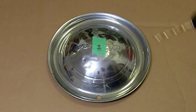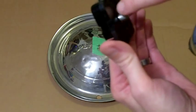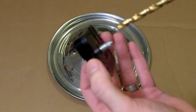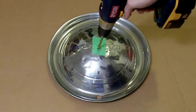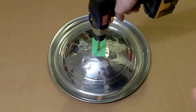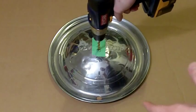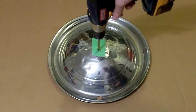Next, find a drill bit whose diameter matches the shaft of the clock mechanism — just barely bigger than that threaded shaft. You don't want it huge and you don't want it too small. Then simply line up on the cross mark you made earlier and drill your hole. Be careful with this metal: if you push too hard it could dent it, or it could push a bunch of metal out the back, which would be really hard to file down to get the clock mechanism to sit flush. Just drill your hole carefully.